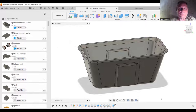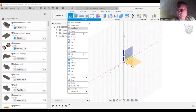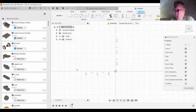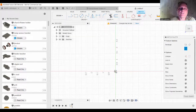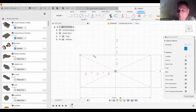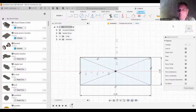Let's start with a new design and start with the bottom. We'll create a sketch on the XY plane. To keep things centered, I like to use a center point rectangle where you just put in the center point and draw it out. So we put in 6.200, tab over, and the other dimension is 2.400. And there's the bottom of our flower liner.